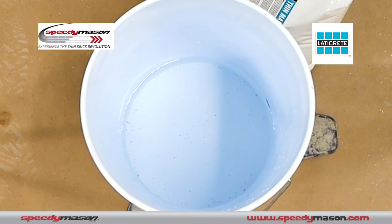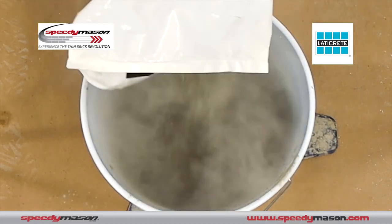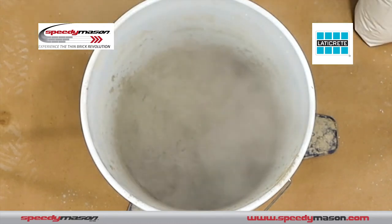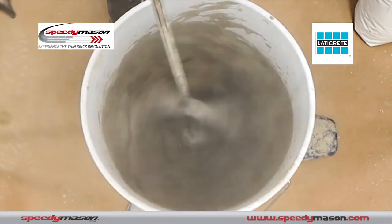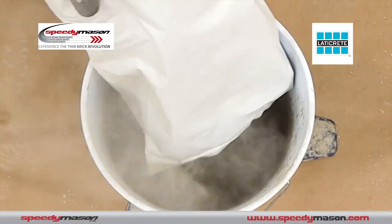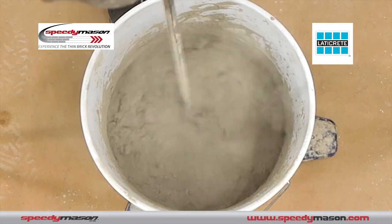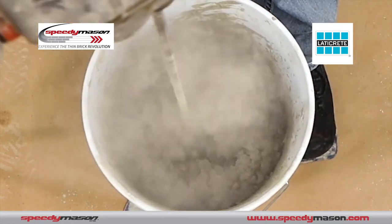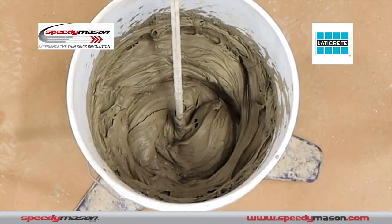I'm just going to take my bag of mortar. I've got my water to my line. Just going to open this thing up. Add a little bit. Get it going. So I've mixed this up for 1 minute, and now I'm going to let it slack for 5 minutes. Then I'm going to re-agitate it, and we'll be ready to go.